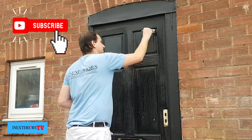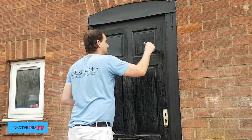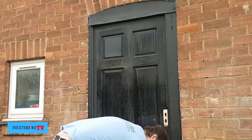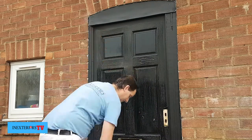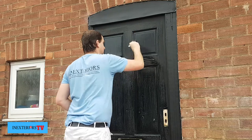When I've painted a panel, I like to wipe the edges — the reason I do this is because it stops any fat edges and any build up there. If you're using oil-based paint, use turps to wipe the edges with.